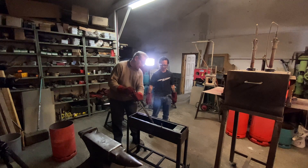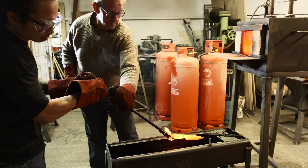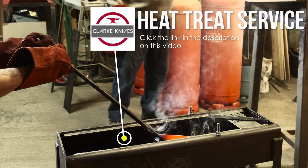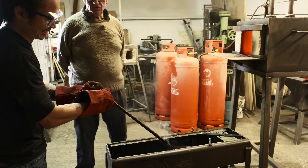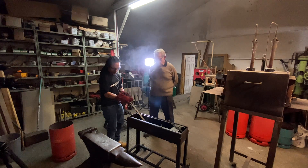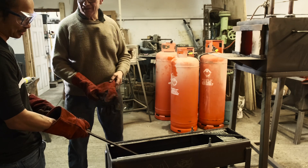Okay, that should do it. I'll just bring it straight back and drop to the bottom of the tank. If you have a look at your blade, it's just nice to come up to temperature there. Get him into that oil, squeeze hard, drop it onto the bar. Just keep the back end there just above the line of the oil — that's perfect. If you drop it, you do have to go in head first to get it — that's the rule in this place. Now just pull him straight back towards yourself, keeping it in the oil. As soon as it comes off that bar, down to the bottom. Relax — don't let go of it with the tongs, but just relax the pressure and the whole lot will drop to the bottom and you won't get so much cramp in your fingers.